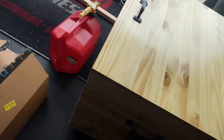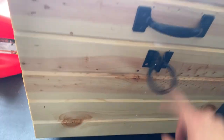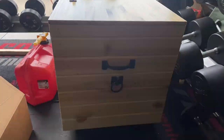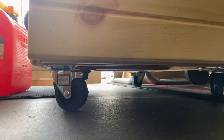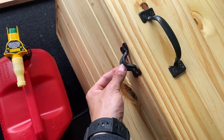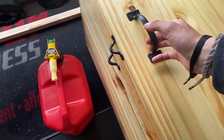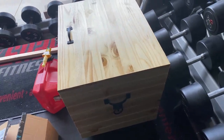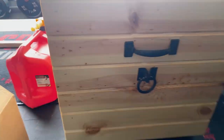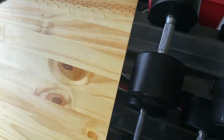Over here is a custom-built box or chest for my espresso machine — I did build this as well. I put the bull ring hooks on both sides so that I can attach it to the hooks over there on the trailer. I do have these handles, and there are caster wheels on the bottom. I have two little rope hooks right here so that I can put a lock here — if I have an event and I put my machine in here, no one can take it because it is locked up. One thing to note: if you are going to build anything out of wood and you're going to have something that is hot or cooling down into it, you have to make sure you seal the wood, otherwise the wood is going to bow.